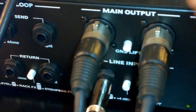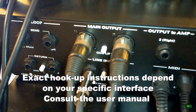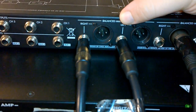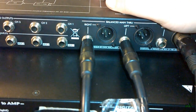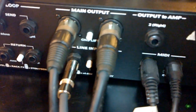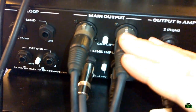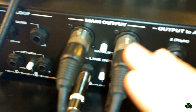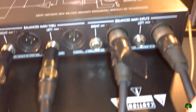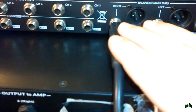So the main output of the 11 rack — or whatever your interface may be — will run into the balanced main inputs right here. My monitors are plugged into the balanced main through of the Head Amp 6 Pro. Usually you have your monitors plugged into the main output of your interface, but because I'm using a headphone amp, I want to run my signal from my interface into the Head Amp 6 Pro so I'm able to make my headphone mixes.